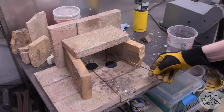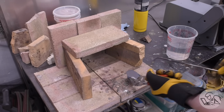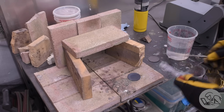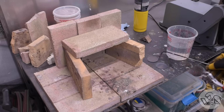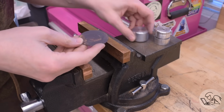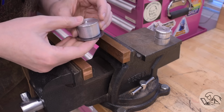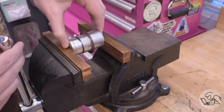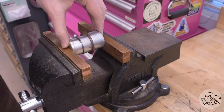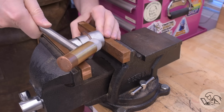Yellow metals do not harden when quenched like high carbon content steel does. But I don't do that with the first annealing because it will warp it because the sheets are thin and flat. So I put it on the bench and do kind of a plate quench. But once it has a little bit of shape to it, you can start quenching it with each anneal. Once it's cooled down, I can line it up with my hammer form, and I use the inner circle that I had scribed on these pieces. I know you can't see them on camera, but they are still visible to me in person. That allows me to get the hammer form centered on the piece for the initial hammer forming. And away we go.